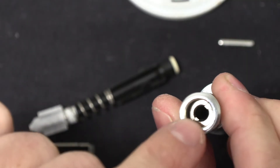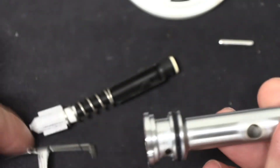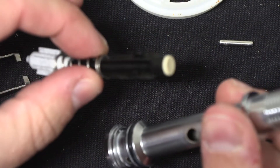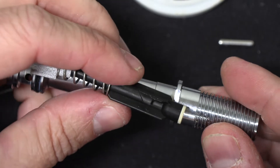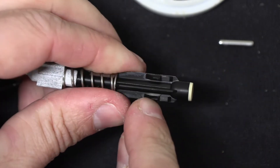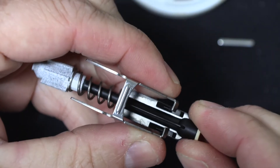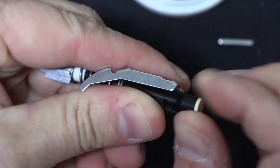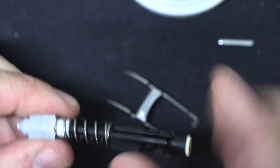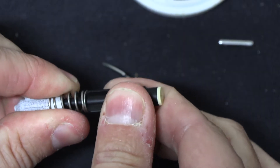And that is the valve that's actually going to allow you to get air. We have a valve seat that's threaded in here — that's the piece with the cross slot. That takes a specialised tool to take out, so I'm going to leave it in there. And then this guy presses up against it — it's a soft material that seals up there. The plastic element here has these two fins on it, and this lever has two pads that sit on those two fins, just like that.